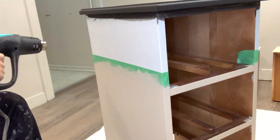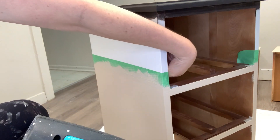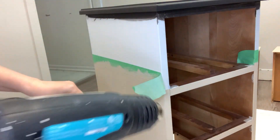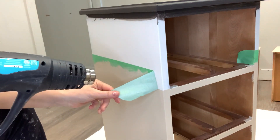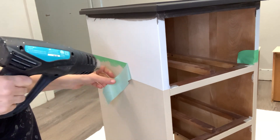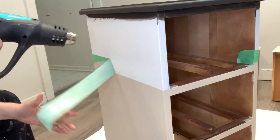Here's a quick tip: if you've ever left your painter's tape on too long and you're concerned it's going to peel back some of the paint when you rip it off, use heat. If you add heat to any sort of adhesive tape, it loosens it up. I'm taking my heat gun, using it on the painter's tape that sat overnight, and it comes off super easy.